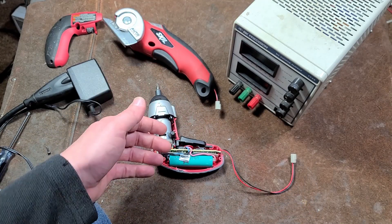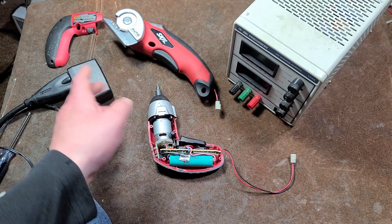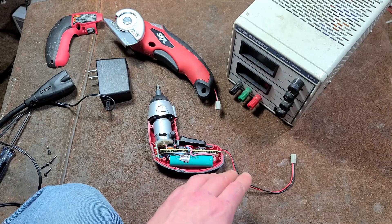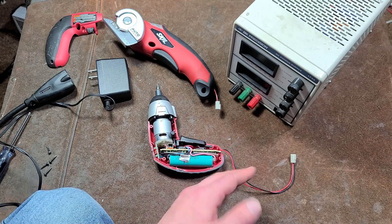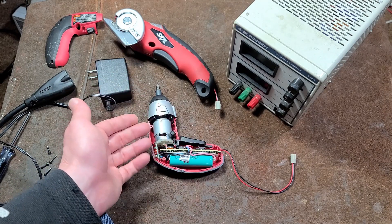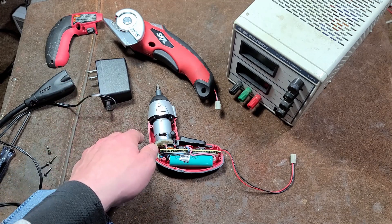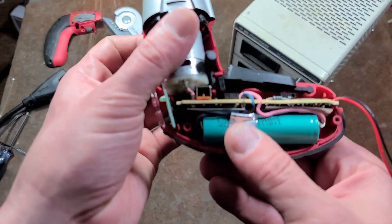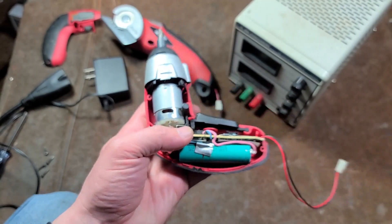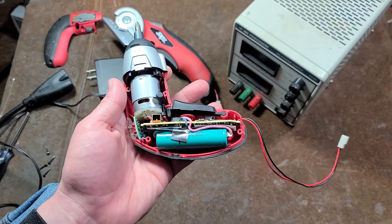It's either like 5 or 6 volts — there are other voltages that are more common, like 7.5 volts is much more common than 5.5. Hence, I could only find a 6-volt power brick. At about 5.5 volts it seems to be okay, and even if the charger was 5.5, giving it 6 volts is still very close to the nominal. The LED seems to have the appropriate brightness and it indeed charged up fine; the LED does turn off when it's done. I also knew this had a little safety: this sticker is actually a temperature sensor — in case the battery overheats, it will shut down charging. So I thought with that additional safety, 6 volts would be fine, and I've charged this up dozens of times and 6 volts has proven to be great.